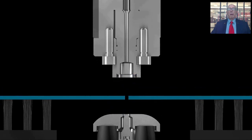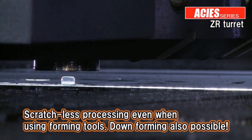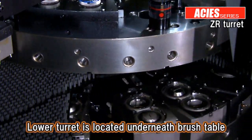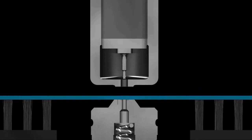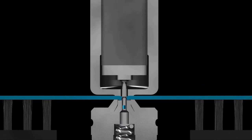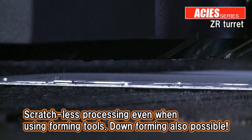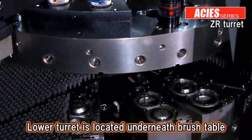In the case of a forming die, the die is raised to the required height for forming and then quickly retracted before the sheet moves to the next forming position. This system also eliminates the requirement of shimming dies after a sharpening process, as the retractable die system will compensate for the new height of a die after sharpening. Additionally, the full brush table and retractable die system now make it possible to do downward forming, a process which would be considered taboo in a standard turret. All issues of tool arrangement, shimming, and scratching are eliminated with the retractable die system.